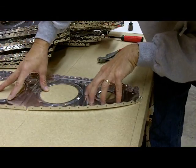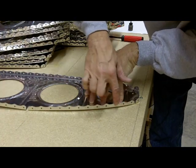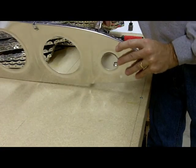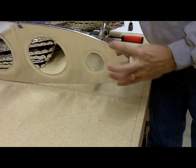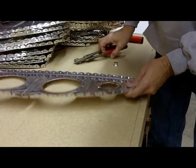Here's a case where light finger pressure won't get the rib to sit flat on the table. What this means is I didn't get these flutes along the nose deep enough. So I'll just make them a little bit deeper — you can actually see the edge moving into alignment as you squeeze them.